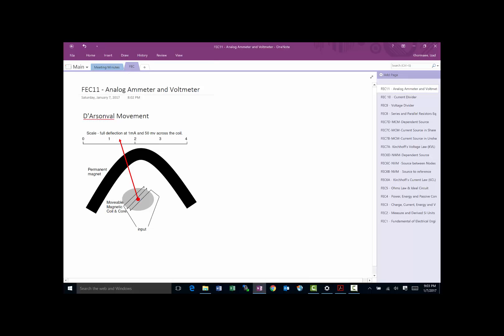It's relatively simple: when electricity flows through here — say you put a plus/minus voltage here and have a current flowing through — this piece of metal inside gets magnetized and gets attracted to the permanent magnet. It's spring-loaded and returns to zero when there's no voltage. At maximum voltage and current, the dial moves to full deflection.